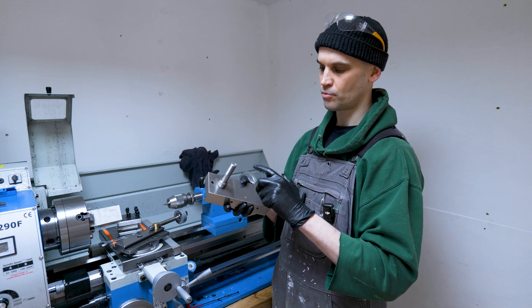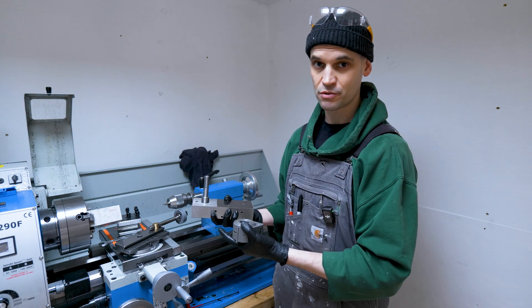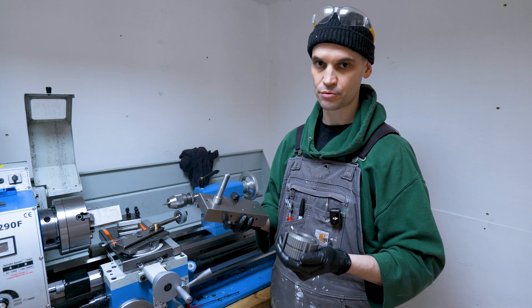I don't want to just make a 1mm wall thickness sleeve because it's going to be very, very difficult to machine. So what I'm going to do is take this down to 16mm diameter in this top section here, and then I'll be able to create a sleeve that will go from 16mm to 26mm. That just gives me a lot more material to work with.